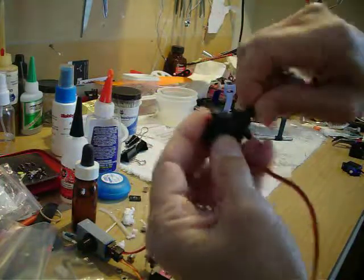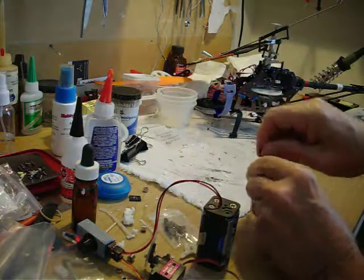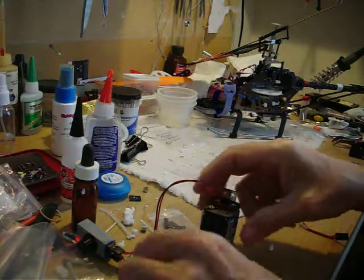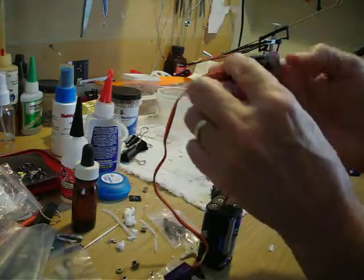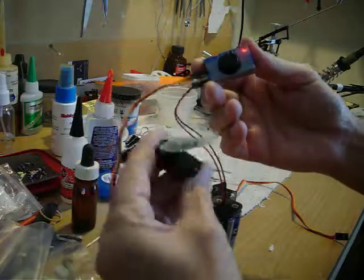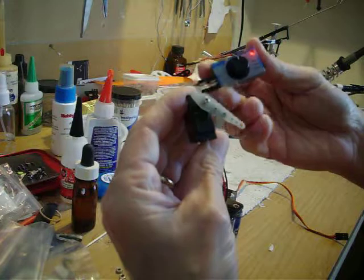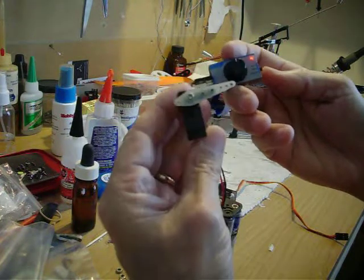You never do that fast or slow if it's powered on. If it's powered off, you can do it very slowly and maybe you won't damage it. Once you've got it hooked up, you can just test it if you want. You go to the down position — it's automatic. This one's got about 120 degrees of throw. Looks like it's good. Go back to the middle position and it centers again.